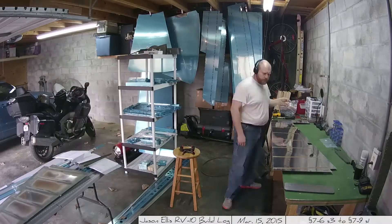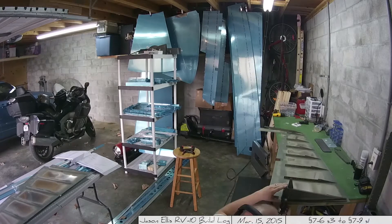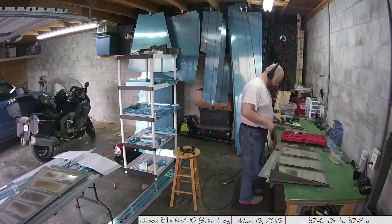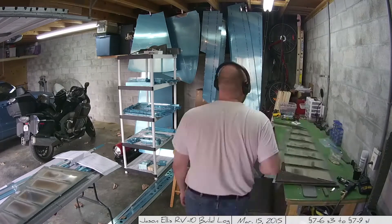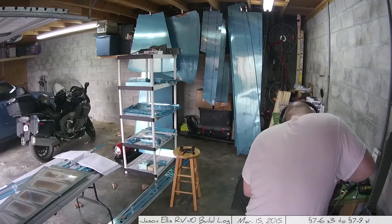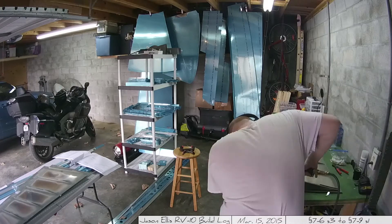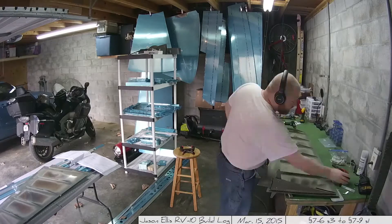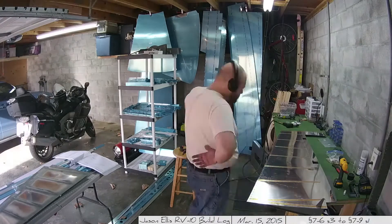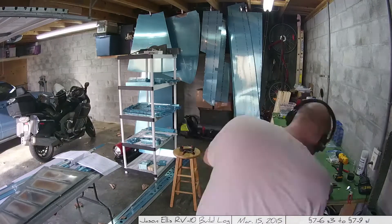I did have a difficult time back riveting — not this piece you see me working on now, but that bottom piece at the very end. I go through and drill some of those out because they didn't come as clean as I wanted. So using the squeezer sometimes, sometimes not. It really was an angle issue. You can see here the way I've got the back rivet plate, using the tungsten bar and bucking against it to use it as a foothold — terrible camera angle because my back is in the way half the time.